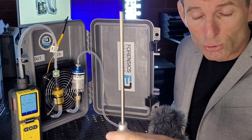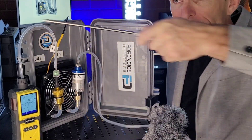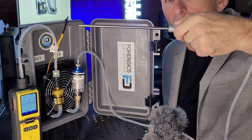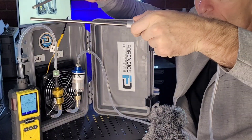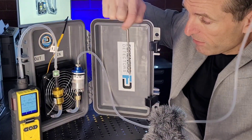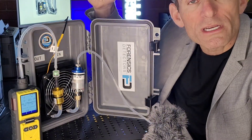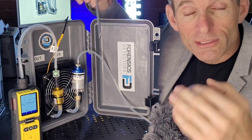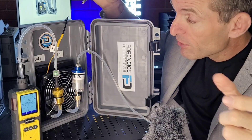This system can accept gas for short periods of time, up to 400 degrees Fahrenheit. When you pop in your probe — which comes with the unit, it's a nice full probe, all metal, all aluminum — the gas will run through the high temperature silicone and through the water trap into the cooling system. We want to cool the gas down to less than 100 degrees Fahrenheit so the analyzer can accept the gas within the safe operating temperature.